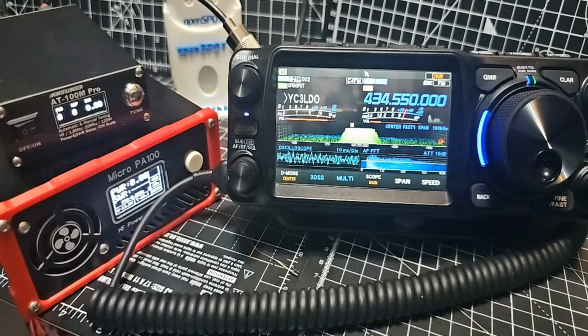20 odd years ago, it used to be on the same, well, it still is on the same frequency, but the SR repeater in Brighton, GB3SR, was on 145.600. And I could get into it okay. It's about 50 miles down the coast from me. It was in a fairly good location up at the racecourse, and I could get a good shout into that, no problem from here.